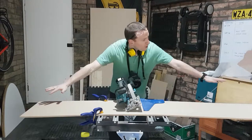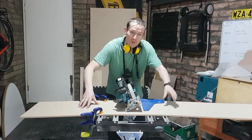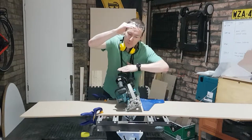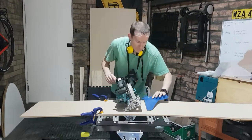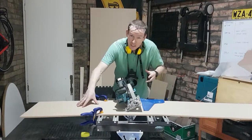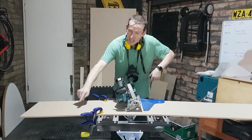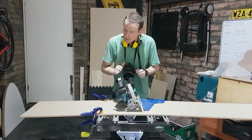Time to make the four sides of the toy box. This is an entire length of MDF which I cut down in the car park. Fortunately, thanks to the good plans, it is almost the exact right height for the box already. I'm going to be able to use my square cut to make my life nice and easy. I'm putting the short sides in first, other than the base, because that way the base is going to help hold them in.